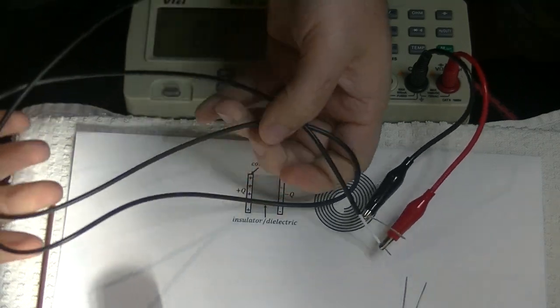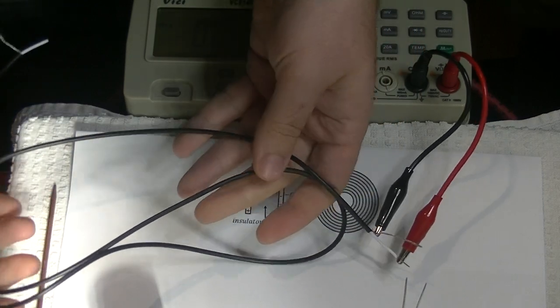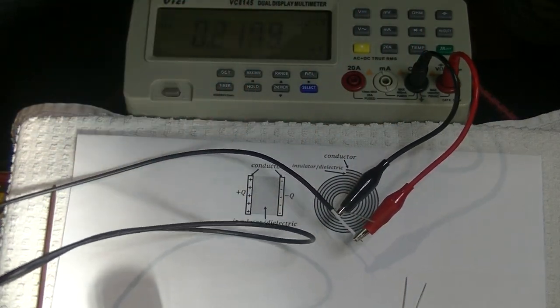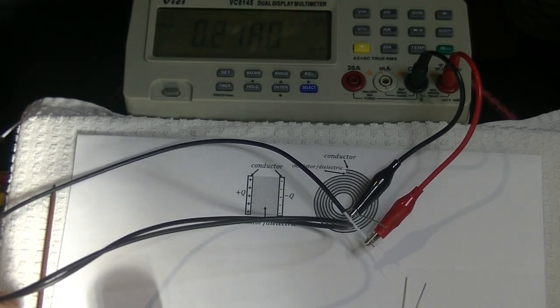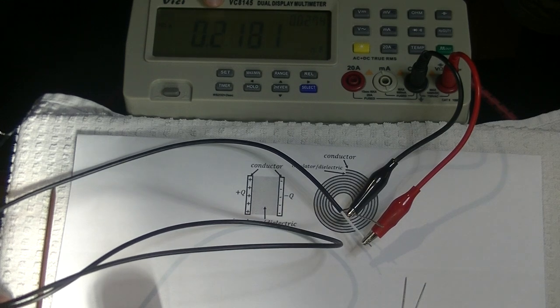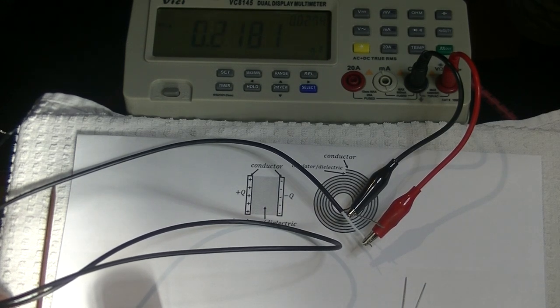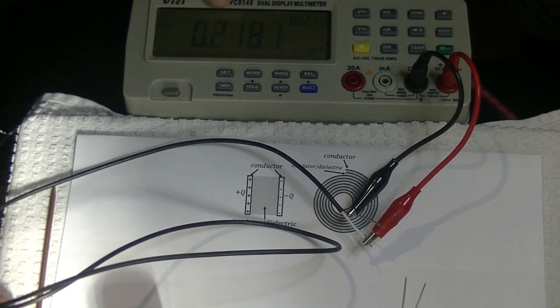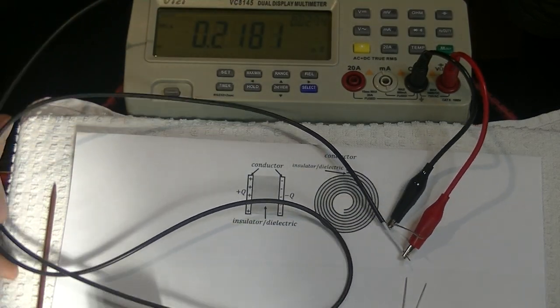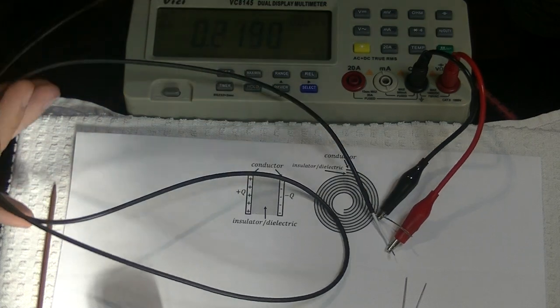Now, this length is the same length, I think, or close to it, as the RCA cable you just did. Right. Somewhere around a meter or a meter and a third. And take a look at the capacitance. So the other one was around 310, I believe, and we're at about 220 here. So we've seen a capacitance drop of about a third in just a different cable type.